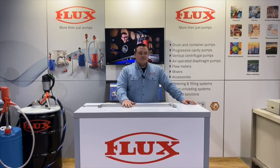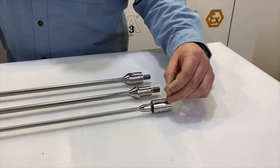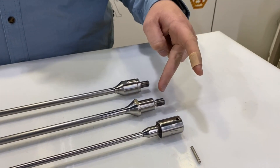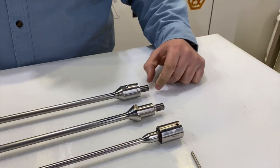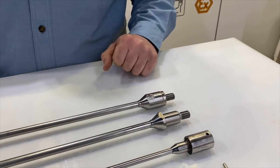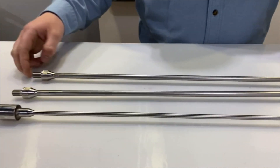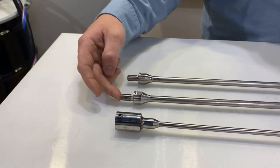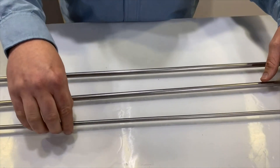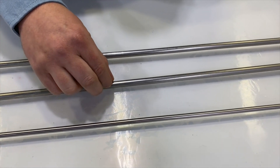Comparing the different shaft designs — the F550 shaft uses a pinned connection into both the gearbox and the rotor. The open seal shaft for the Visco Power threads directly into the gearbox shaft as well as the rotor. The closed seal shaft similarly has a notch for alignment and a shoulder to hold the seal in place, threading directly into the gearbox shaft and rotor. The shaft diameter has also been increased from 7mm on the F550 to 10mm on the Visco Power line.